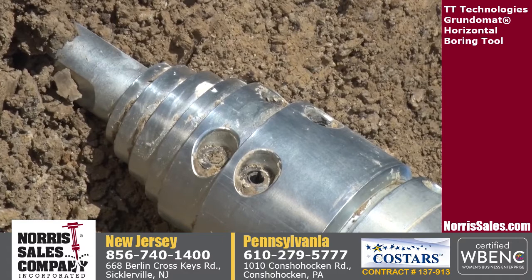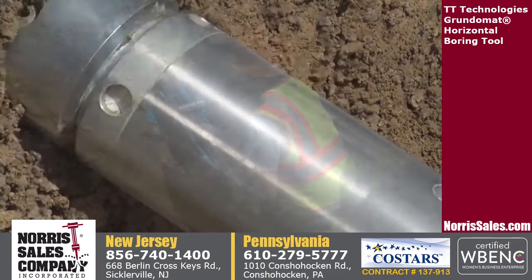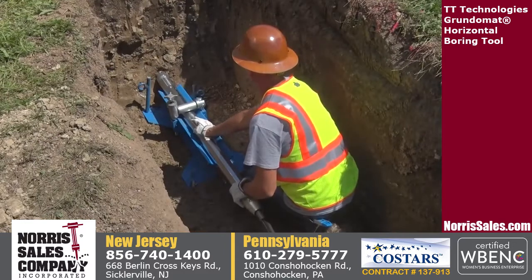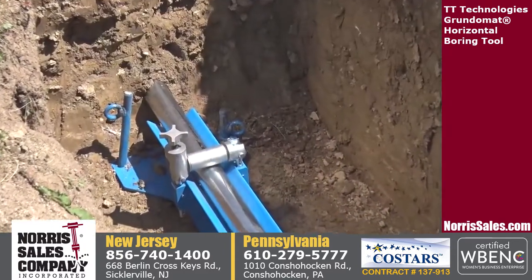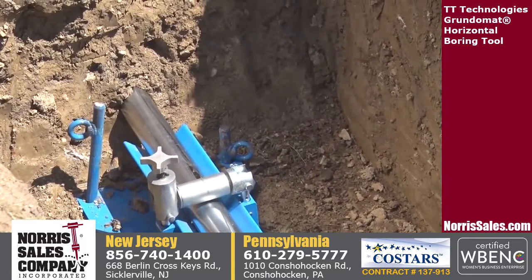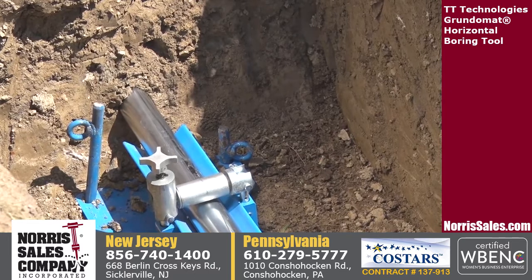Grundomat pneumatic piercing tools have been providing accurate horizontal bores beneath roads, railways, and landscaping for over 50 years. The Grundomat piercing tool can perform accurate horizontal bores up to 150 feet in length and can be easily configured to pull in a wide variety of new pipe materials.